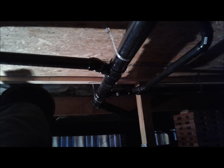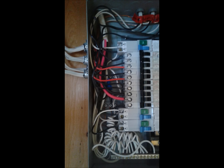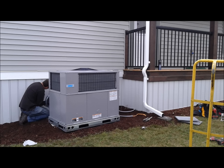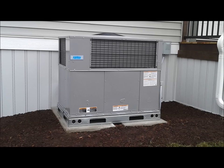There was quite a bit of work done from the top as well. We also installed new drain, waste, and vent pipes. For electrical, we installed a lot of new outlets and upgraded to arc fault breakers in the bedroom areas per code, bringing everything up to current code. Then we had the HVAC system installed — a combination heating and cooling unit that sits outside, which got rid of the furnace inside. The space where the old furnace was became occupied by the fridge, giving us more room in the kitchen.